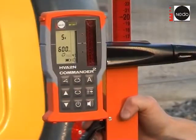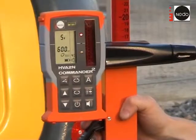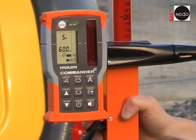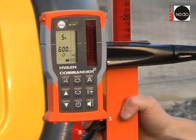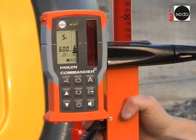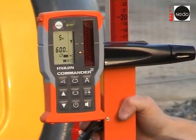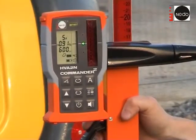The Commander 2 will tilt and incline the laser plane until it hits exactly the zero line of the receiver. When Auto-Align Single is finished, the display shows the slope of the area — here 0.91%.